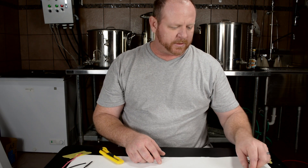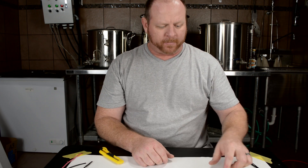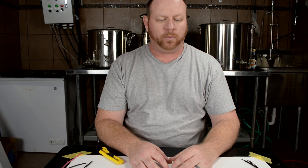Incidentally, I've got a piece of tape down here — this is a little tip for you. If you put a piece of tape down and flip it around so that the sticky side is up — I've got some painter's tape — you can stick your connectors to that so you're not chasing them all over the table whenever you're doing your wiring.